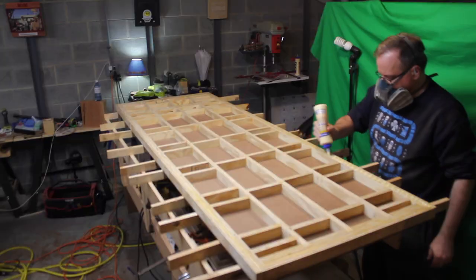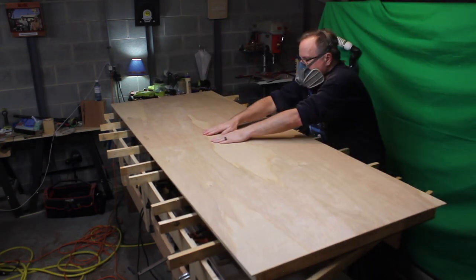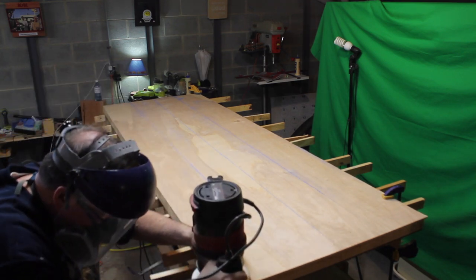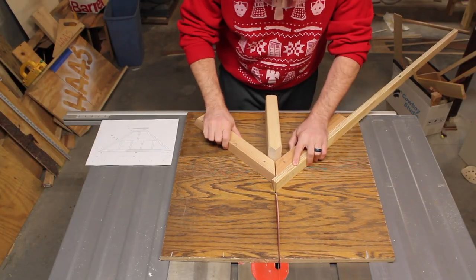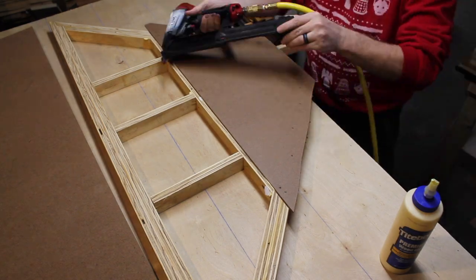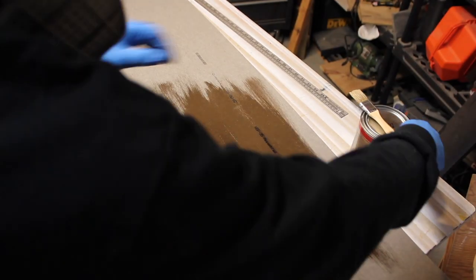After this, I turn the table around and, not surprisingly, more wood glue and brad nails of course. After I use the jigsaw to get the surface close to the edge, once again here comes the router to clean everything up — sawdust is cool. Now I get to play with angles for the corner piece. Same technique: build the frame, add the backer, lots of brad nails, trim, and route. Here's the surface — plywood, trim it, route it. And now we're ready for the laminate.